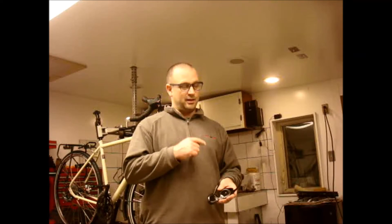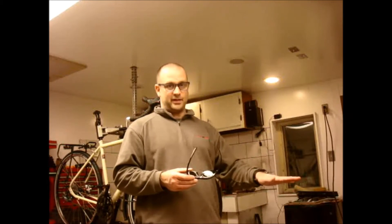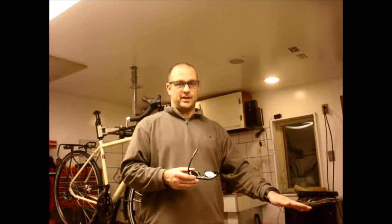I've cut quarter-inch steel with this and in a minute I maybe make it about that far. Aluminum, brass, and non-ferrous materials cut a lot faster — you'll see this aluminum cut really quickly today. 3/16ths aluminum is about 10 times faster than steel.